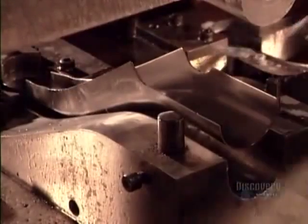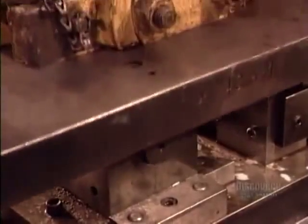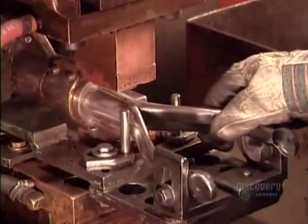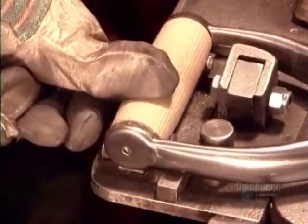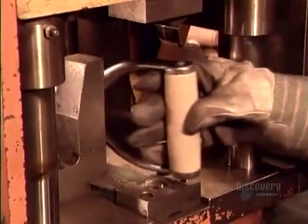To make the sides of the grip, workers begin with two pre-cut pieces of steel called blanks. They place them in a manually operated press that shapes them in a two-step process. They use the heat of a strong electrical current to melt the steel and fuse the pieces together — this is called resistance welding. Next, they feed a steel rivet through the sides and wooden insert, and fasten everything together.